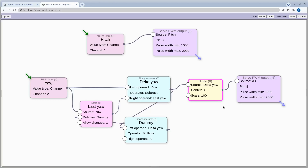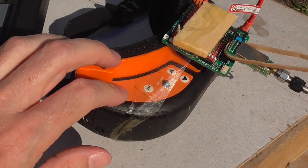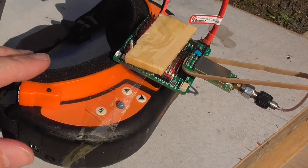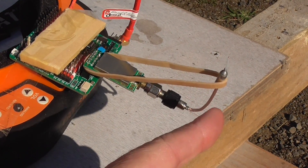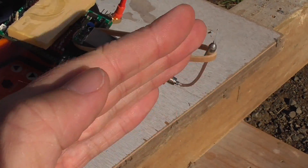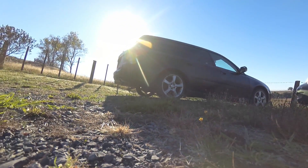There's a bit of scaling because it was too small if you just use the delta. That's about all that needed to be done — it actually took me about five times as long to do all the wiring and sticking things onto the hexacopter as it did to set up this program. For today's experiment I've stuck the SBUS mixer on top of my FatShark goggles with a bit of velcro tape and some sellotape, and put a rubber band loosely on to make the antenna stand up vertically. Let's arm.